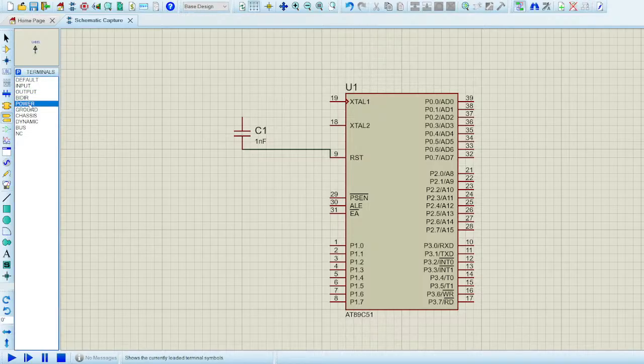First of all, let me build a circuit. Let me place a supply over here, and the only component now left is a resistor. I'll place a resistor as well, and connect it this way. You don't have to worry about connecting a capacitor and a resistor in this fashion; in Proteus it will work without them. Now I'll connect the ground. After connecting ground, the circuit is nearly done. But let me change the capacitance as well. Let me do 100 nanofarad, which is 0.1 microfarad.